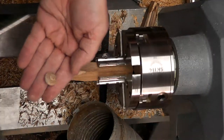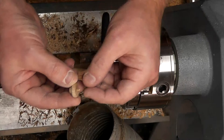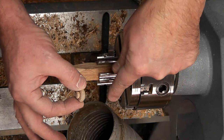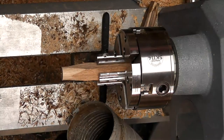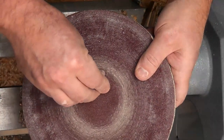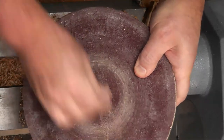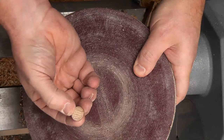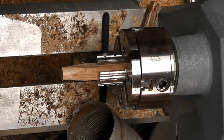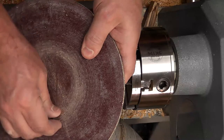What I'm going to do now for you, if we try and sand nibs that you've left on that away, you'll end up sanding your fingernails and that will get lost down the extractor. Okay, so don't do this under power, but if you have the sander or your sanding disc and literally just use it as a flat surface, and that'll clean that off for you, give you a nice flat finish. And if I grab the head that I've just made, where did I do it? There. Got to do the same thing.